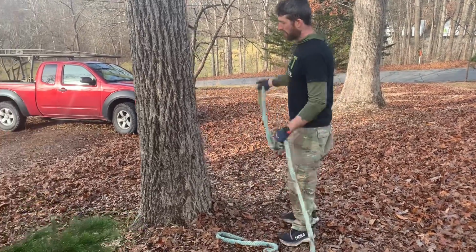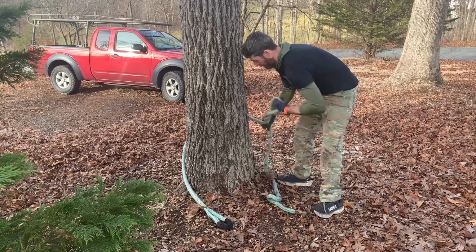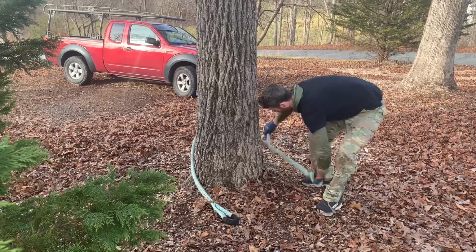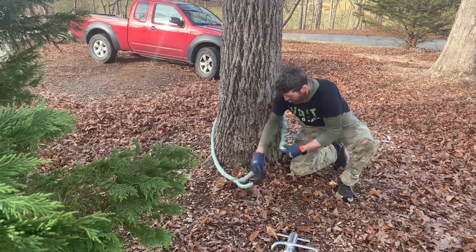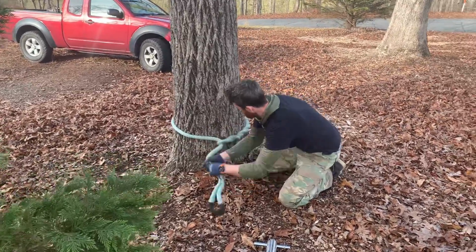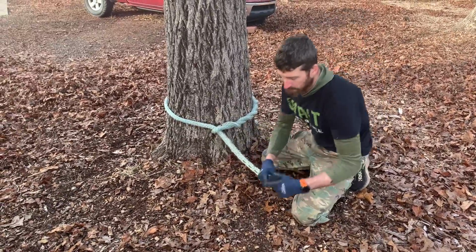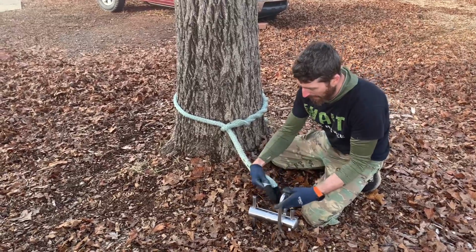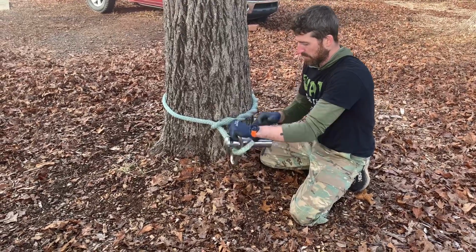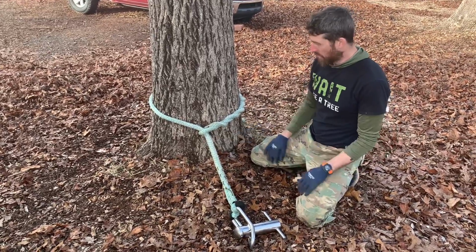All right, so first we're just gonna take our dead-eye sling, swing it around, and then we're going to start putting twists in here. We make a bite and then we start twisting it up a bunch of times. And then we just simply pass the eye through, press it up a little bit, make sure we're good. And this is why we need a little bit more extension in this case, because we need the eye to go through the entire Porta-wrap. So we go around that longer section and we've set up a Porta-wrap much faster.